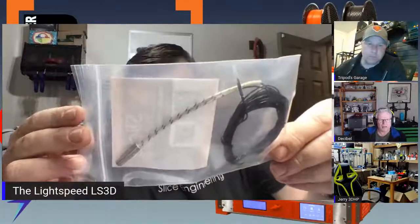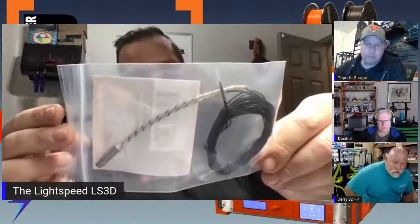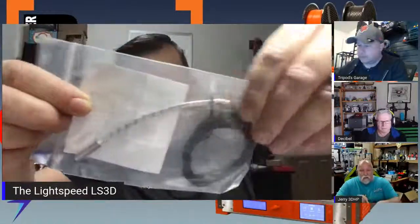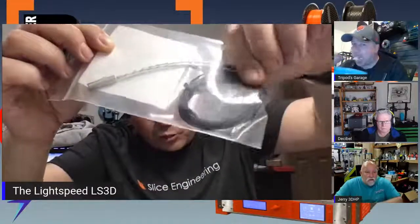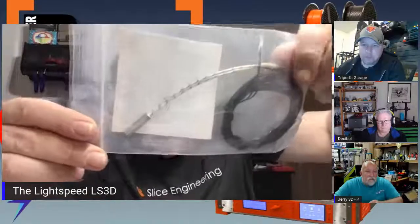And I like the wiring. None of that little thin wiring at the end of it, which is good. So this is all sleeved with something, but this is all PTFE lined wire, so when you're in a bundle, it won't stick or chafe. Pretty clever little design. I like that. It's got the heat proof sleeves, the asbestos type heat proof cotton woven sleeve on it.